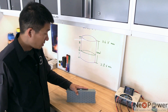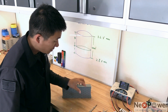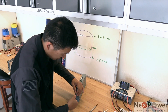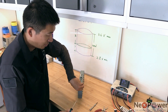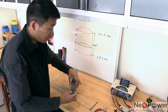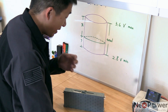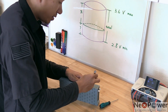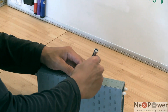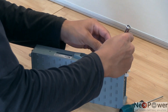Let's get the operation started. First thing, unscrew — there are a total of four screws holding the top cover. I'm using a special blade as an example because that's the only blade I have right now, so you will see terminals on both sides. The second step is to pry open the top cover. There is some glue in there to minimize vibration of the cover, so you'll need to stick your flat head screwdriver in to separate the glue a little bit here and there.